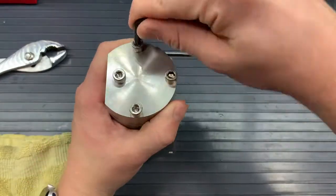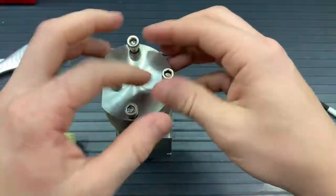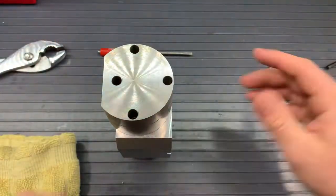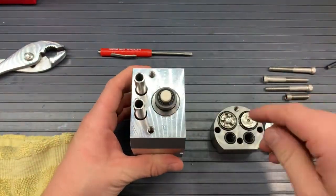Okay, so let's take apart our pumps. First we will turn our pumps onto the heads and take off the bolts on each side. There should be four on one head and we'll undo those. There should be no washers because it's stainless steel on stainless steel — we don't need the washers there. Then we will take off our heads and stuffing boxes from the crankcase.